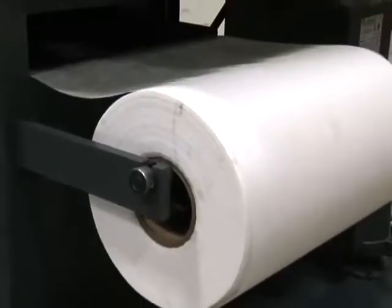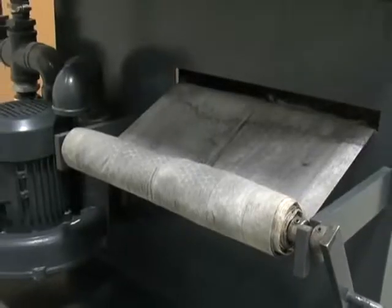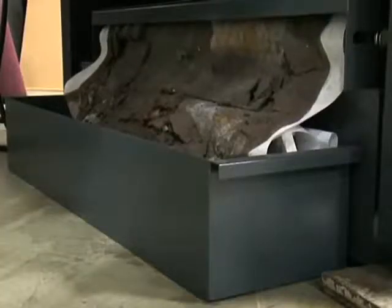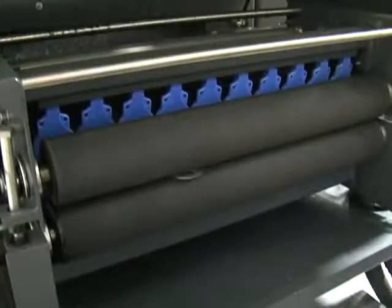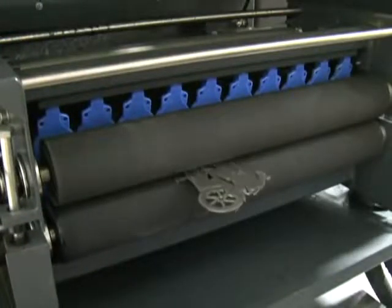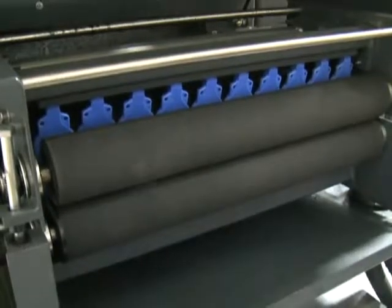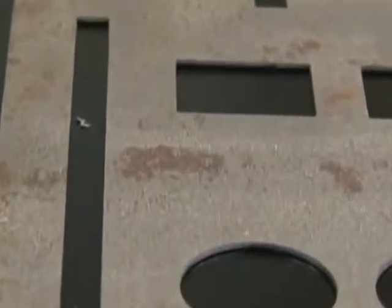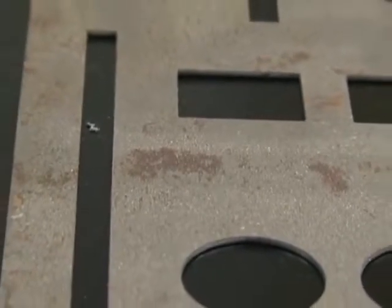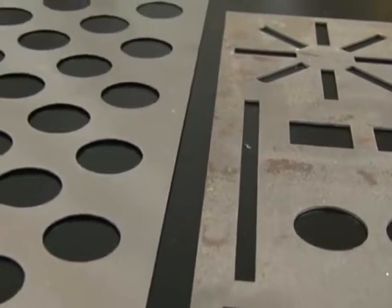Wet machines come with a filter that removes contaminants so the coolant may be recirculated. The filter on larger machines includes sensors that automatically advance the filter paper when necessary. Wet machines include a drying unit, so while the processing is wet, the parts coming out of the machine are dry. There may be some coolant residue left on the parts, which can actually be helpful. The coolant contains rust inhibitors, helping to keep the parts from rusting while sitting on inventory shelves.